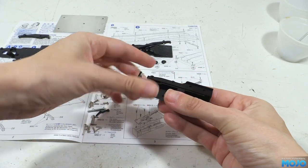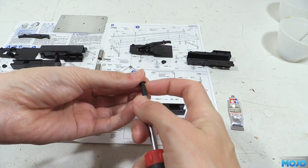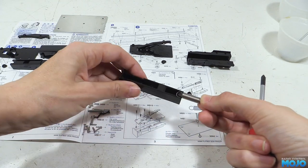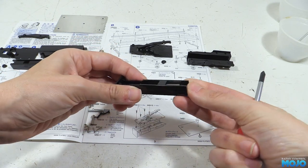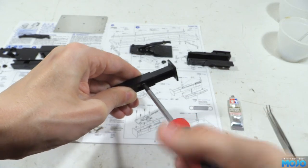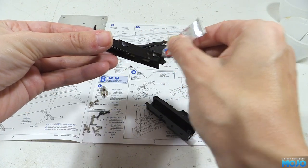Next we need to fit a coil spring inside the leg. We use a 2x6 with a plastic washer to attach it. To make it easier we'll get the washer ready now. The spring slides into the inside of the leg and the loop sits over a hole for the screw. Then while holding it in position we thread in the screw and do it up so it's still just a little bit loose. We want to make a good anchor point for the spring but we don't want to clamp it. Next the leg drops into the cover but first we're going to add a couple of smears of grease to the sides just to avoid hang-ups.